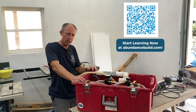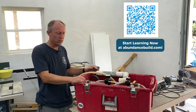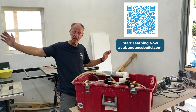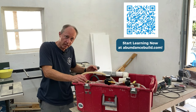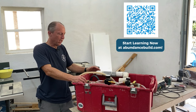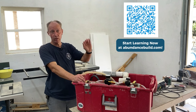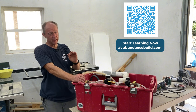Then I started experimenting with adding sand instead of some of the Portland cement, because ultimately, how much strength do you really need? Portland cement is very rarely used pure — when we do stucco or concrete, it just takes a little Portland and lots of sand and rock filler. So Portland can go a long way, and sand and gravel are really cheap. You just need enough binder to coat all your styrofoam beads. Adding sand lets you cut the Portland down even further, and that's how I ended up with the Portland and sand mix.